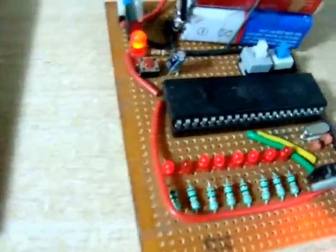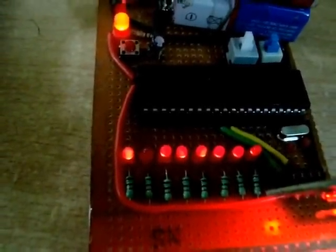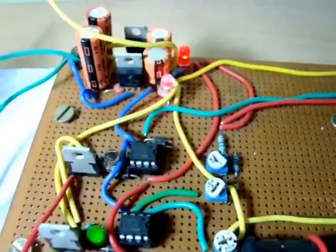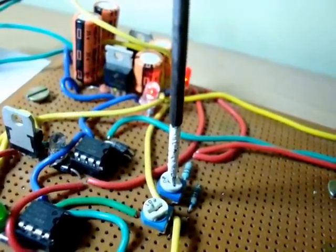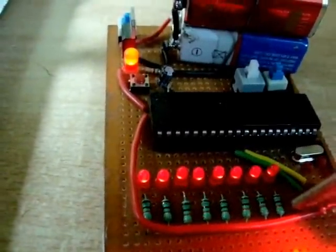As you can see now clearly, the second LED is off and the rest are on. The LED that is off corresponds to the temperature sensor LM35 — it's sensing no heat, so the op-amp output is 0. Now I'm going to change the reference voltage to make the op-amp output logic high. There we go — it switches on, and when it turns on, the signal is transmitted wirelessly and the corresponding LED here turns on.